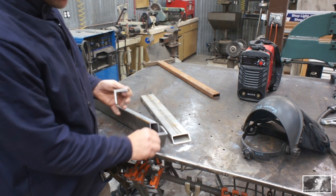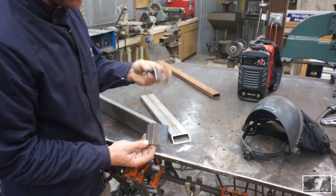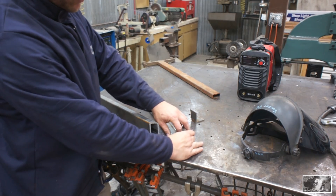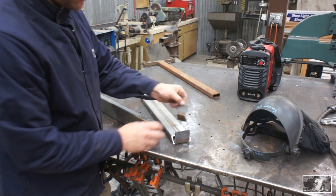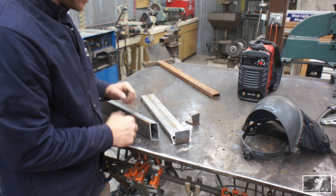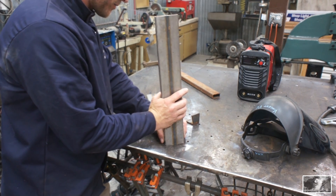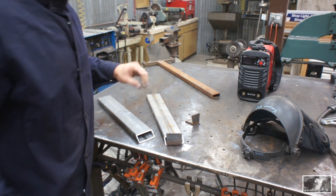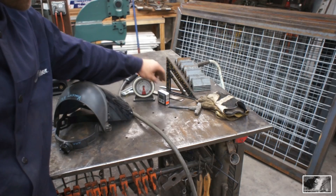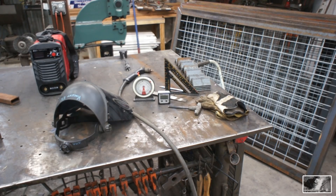We've got these pieces cut. A quick word about what we're going to do — I have these two little remnants, or little drops. They're two by two angle iron, and what we're going to do is cut some key holes in here and weld this in kind of like a fish plate, one on each side, then slip the next piece on and weld it. That's going to give us a really strong corner — not going to flex, it's going to be very rigid. Then we'll fit this up and check it a few different ways. I've got the analog dial indicator angle finder, the digital one, and a couple different squares. We're going to make sure this thing is absolutely perfect.